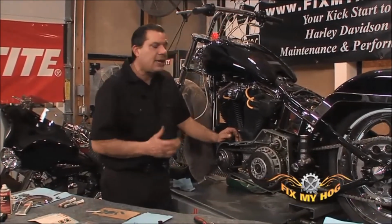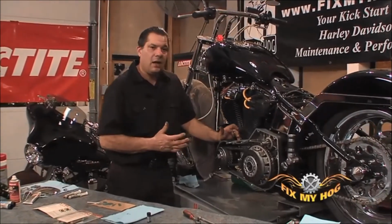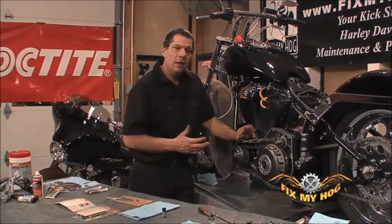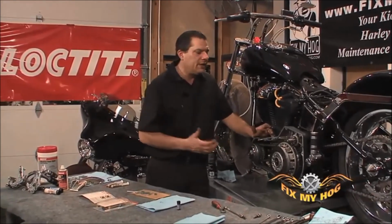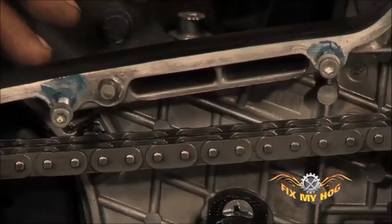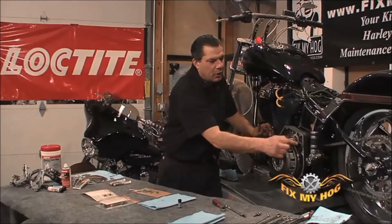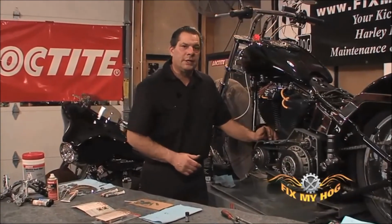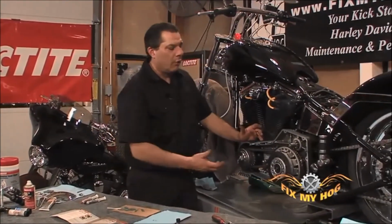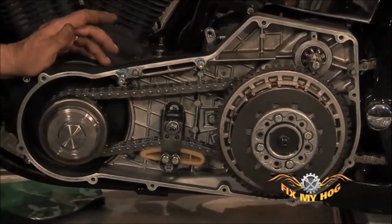But again, Loctite products are made to eliminate any problems with stripped threads. It avoids having to replace a component because of one stripped location. I mean, there's a number of threaded holes on this component. There's really no reason to scrap it or remove it and replace it because 2 bolts have shoddy threads.